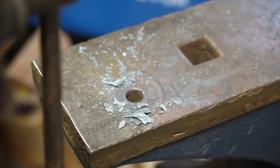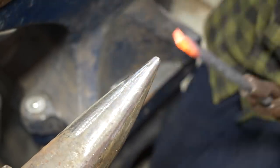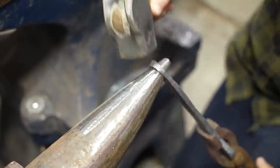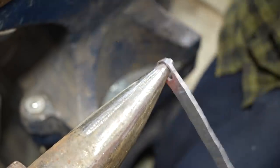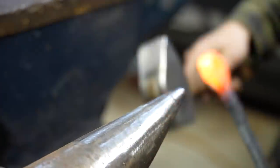It's important that I make sure the material is nice and hot, because I don't want to rip the edge of the material — I really want to get this all done out of one single railroad spike. For most of this project I'm using my pretty large 400-pound anvil, but I have a smaller 120-pound anvil with a much smaller horn on it, and that's perfect for opening up the holes for the scissors.